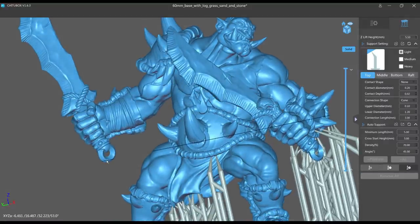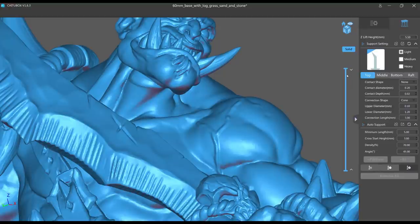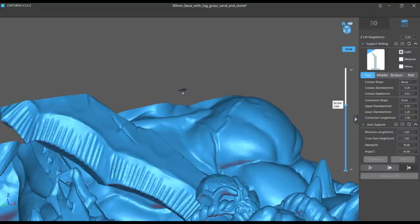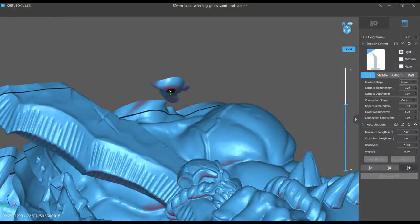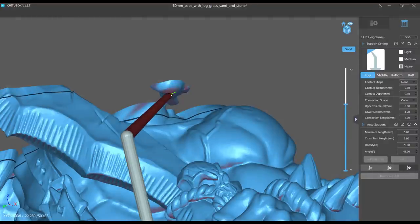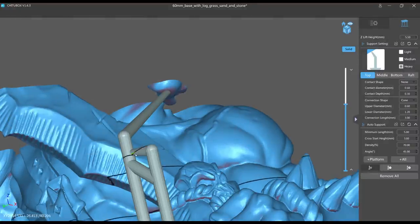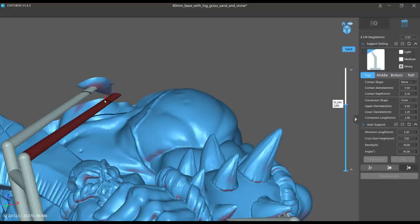So every single island is its own separate model — all you need to do is place the appropriate support to get that mini-model to the next part where it can share support strength and stability. Now looking at his left arm on the left of our screen — that's a separate model, with tons of little sub-models on it. The chin: it has quite a few layers before it joins the model — that's a pretty big unsupported area. I have to treat this chin as its own model, and it's not a small area, which means I need a significant support under it to prevent pancaking. I'm going with a heavy.